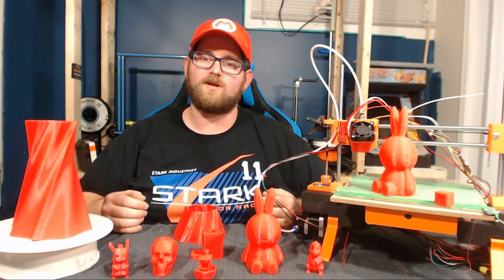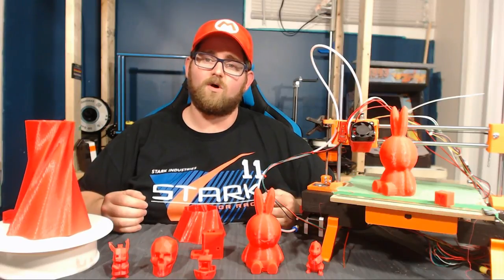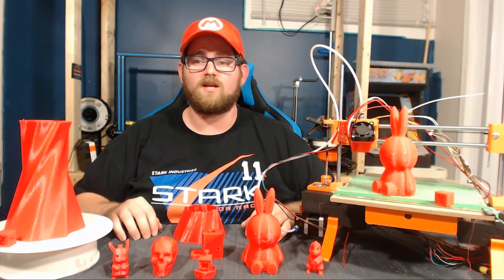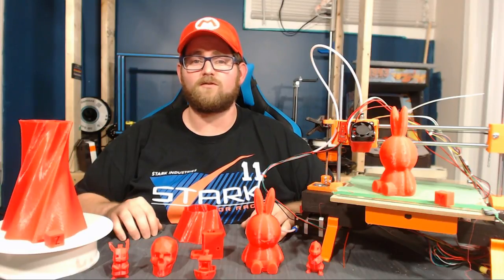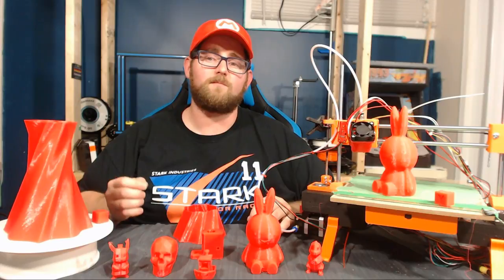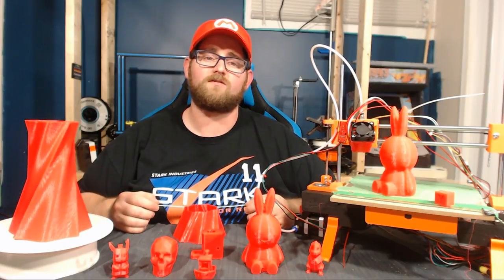Finally, I wanted to make sure the printer would be able to print copies of itself. While this goal highlighted one of the main drawbacks of using the 28BYJ motors — namely that small circles are fairly difficult for them to print — the parts I printed were still clean enough to allow insertion of the smooth rods in the bearings, so I think we can check this goal off as a success.